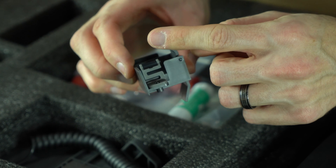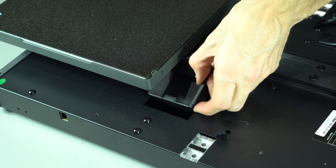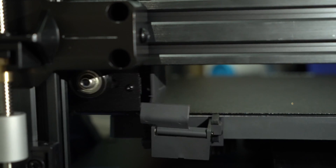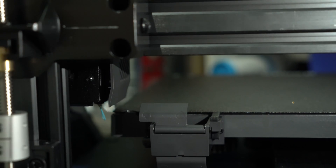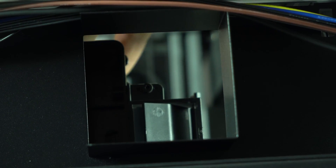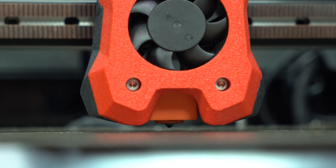The other interesting feature of the X3 is the new purge chute at the rear of the bed, which appears to have been directly inspired by the Bambu X1C, with the wiper looking almost identical. Since this isn't a multi-color capable printer, the function is just to clean the nozzle. Unfortunately, in my testing it didn't work — during the wipe move, the printhead moves too far to the right, allowing the purge chute door to close and resulting in a crash when the printhead moves back. Artillery's technical support, while friendly, were unable to provide a solution, which in reality should be an easy fix with altered gcode. While the purge chute may seem neat at first, it seems like more of a gimmick than something actually useful.